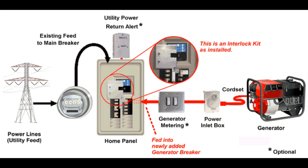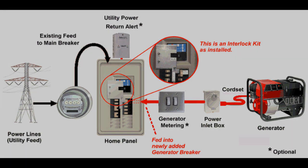Without an interlock or a transfer switch, there is always a chance that someone could forget to open the main breaker, resulting in a danger of electrocution to linemen, destruction of your generator, and fire. Once the interlock is installed, it is quick and easy to transfer power from utility to generator in case of a power outage. With this one connection, you can now use anything in your home because all the circuits in your home can be energized through the breakers in your panel.